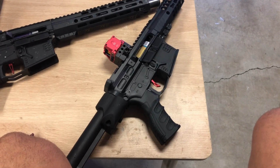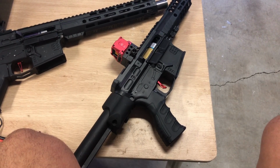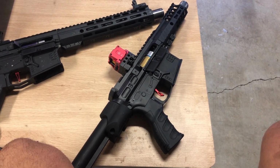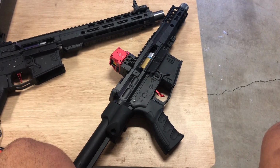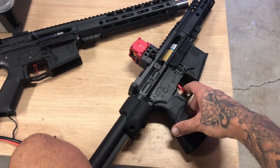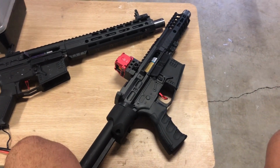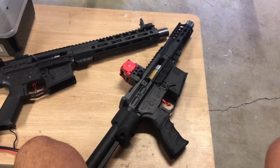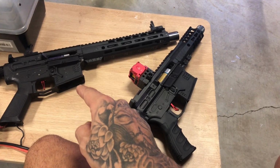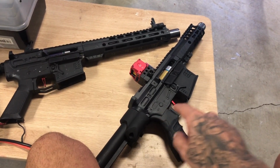That's pretty much it. If you use the right setup with your gears with a Frankentorque, you will have an extremely fast trigger response, and that's why I have gone this way. So I do prefer CQB, and this does give you a little bit of an edge over someone who's running, say, a stock type blaster or slightly modified. The trigger response of this is extremely fast. So yeah, pair your Frankentorque with the right gear set. That one's a DSG, and it's got a 32 TPA. That one there is a DSG also, but in that one I run at 28 TPA just so I have a little bit more speed. So that one I usually run full auto, and this one I basically use just semi.